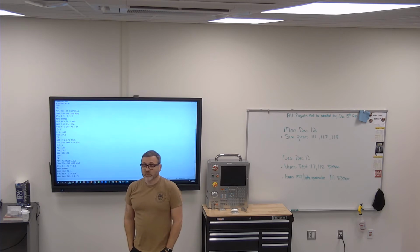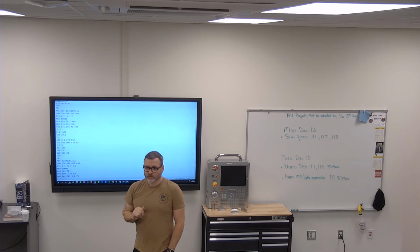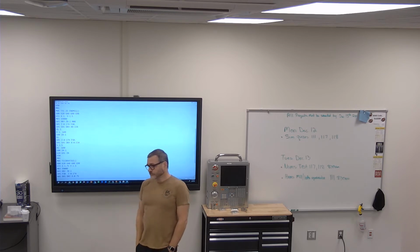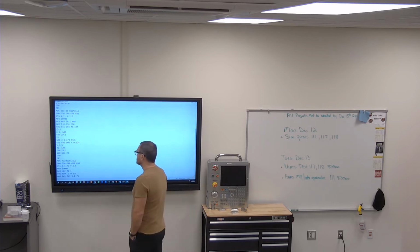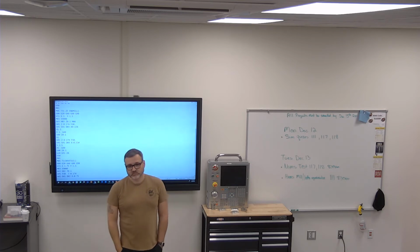When you see a tool or a job description where it says this job uses cutter comp on tool 5, you should be able to go D5 arrow down and find a D5 somewhere in that part program, and that's your diameter compensation for that. That's the same thing down here, 6 lines down also. So G41 is your cutter comp onto the left side.